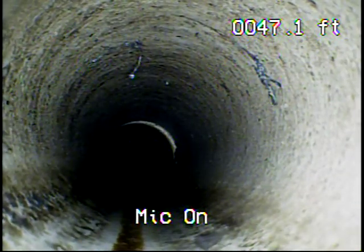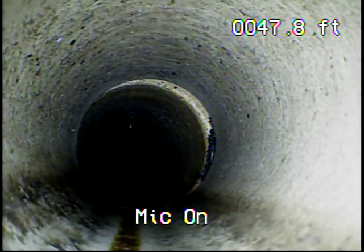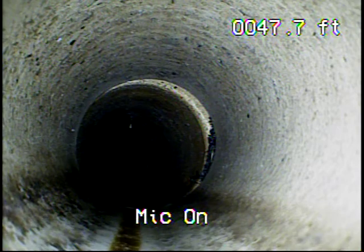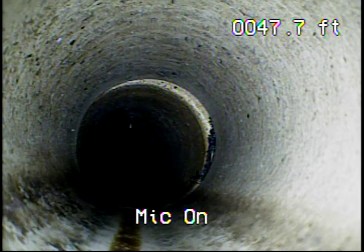And the way they were dangling down, you're going to have to let them get down, kind of bunch up and knot up. You don't want to cut too often, because if you cut a wimpy root, it's juicy, but you're not really cutting it, you're more or less just slicing it. And then with that blade, you're just sticking it to the sidewall. So then instead of growing in a knot, it's growing down your sewer line. So you don't want to cut too often. You want to cut when it's needed.